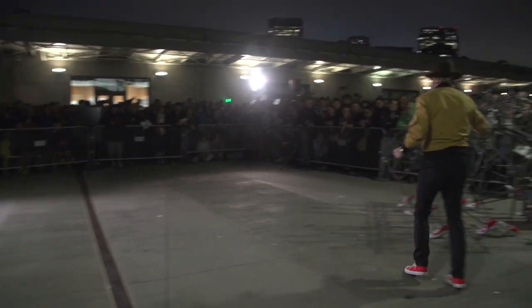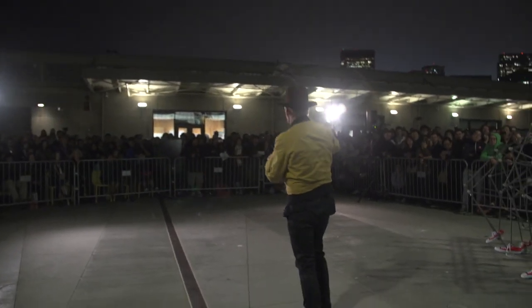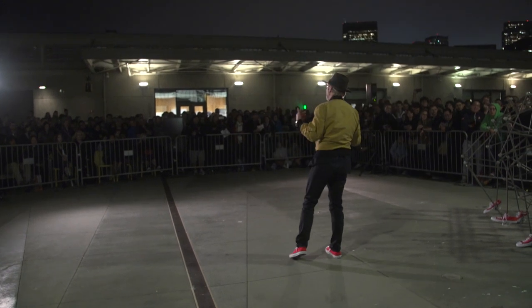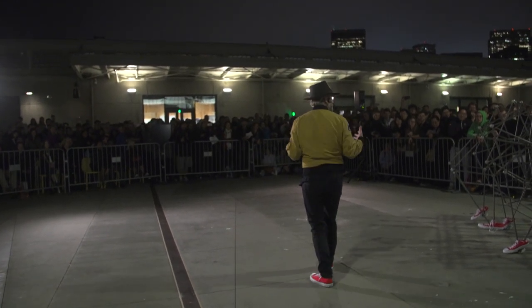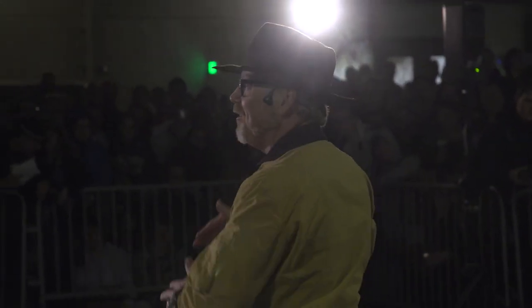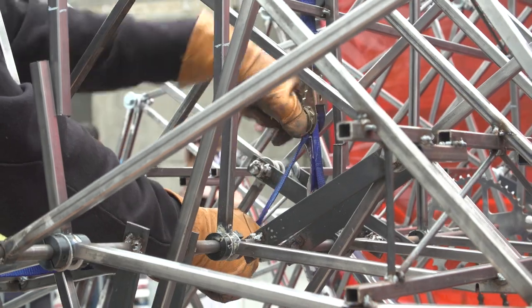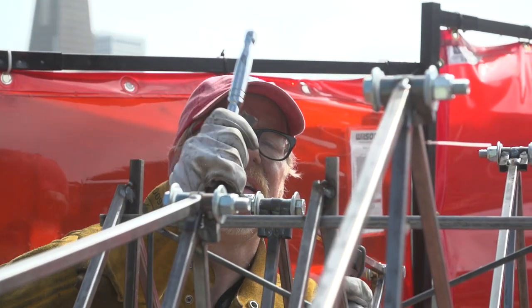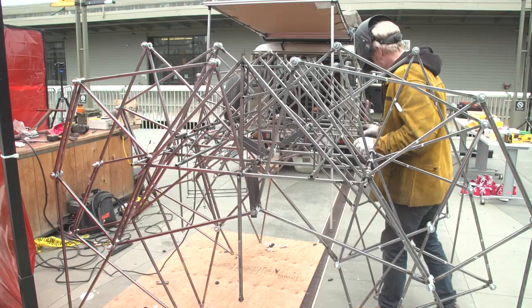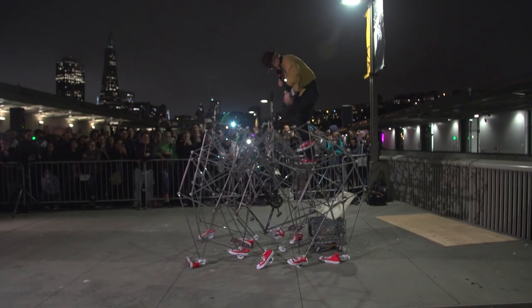And the one that I hadn't transferred was the fact that these three points are not on a line. They actually form a triangle. And I wanted my central crankshaft pivot to be 3.5 inches above the line. So then I was up until 5 trying to figure out the best way to do it. And I cut this thing up in my head about a million different ways before realizing, dummy, there are 8 uprights. All I need to do is measure 3.5 inches on those, cut each one. And then I used a bunch of tie straps to really force the geometry into something new. I recognized that I could have made it go easier by getting it right on the first try. But I think that's generally my lesson in life.